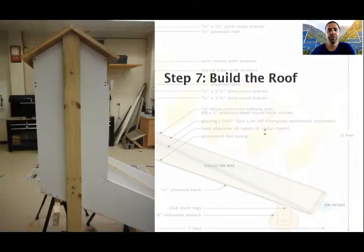The solar dehydrator roof is made of 2 pieces of ¾ inch plywood, preferably scraps you have lying around in your workshop. You can also create ¾ inch plywood by gluing together several pieces of the ¼ inch plywood left over from cutting the front of the dehydrator. The roof is made up of 12 by 30 inch pieces with 30 degree bevels along one long edge so they can join tightly at the peak. Attach the roof pieces to the dehydrator sides and braces with 1¼ inch screws.